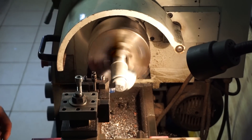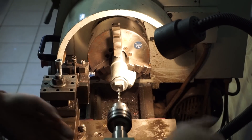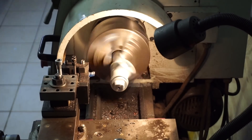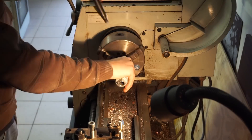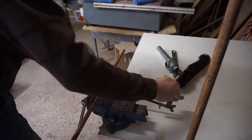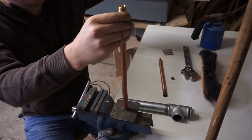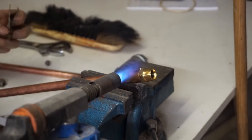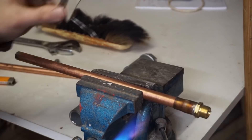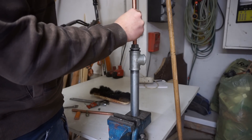The next thing to do is the shroud. Assembling the shroud tube, the tee piece, and the end cap allowed me to bore the hole for the gas tube on the lathe. It had been faced flat, pre-drilled, and then bored to the outer diameter of the gas pipe using a small boring bar. Now we can start assembling the gas tube: first I pressed the nozzle into the front end, then on the back end I soldered on the fitting for the gas hose. Make sure to test the soldering joint for any leaks before you mount it in your forge, and also make sure that the gas tube does not get too hot.